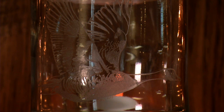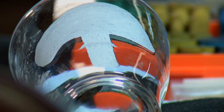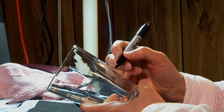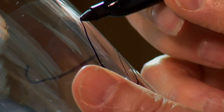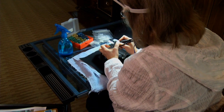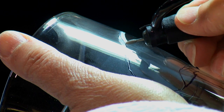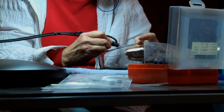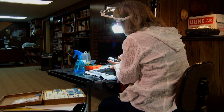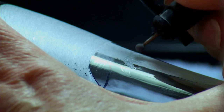Because a lot of the glass I engrave is rounded like a drinking glass, you have to put an image on it with a Sharpie first. If you don't have an outline of the image on the glass, you can very quickly lose your perspective, because it's transparent and when you look at something straight on a rounded piece of glass, the image sometimes will change direction on you. So the first thing you want to do is put an outline on there so you've got some perimeters to stay within. Then you just start filling it in and doing the detail work, choosing the different bits and burrs that will give you the depth, the color, the grays, whatever detail you want.